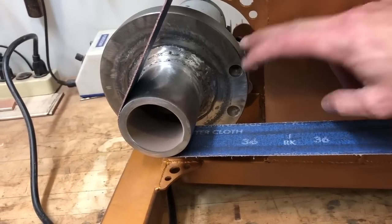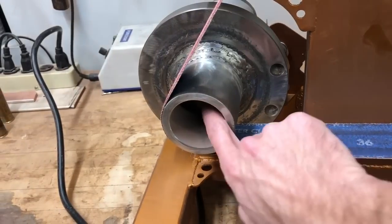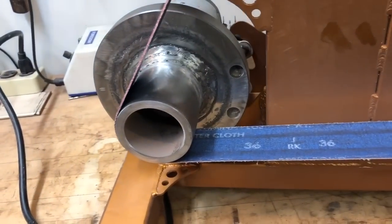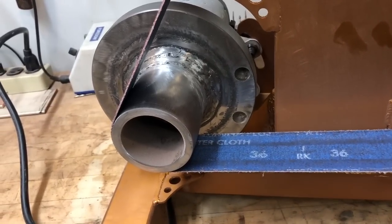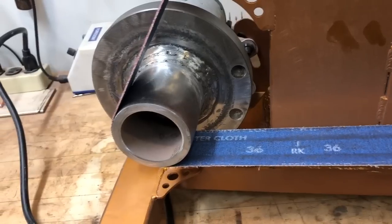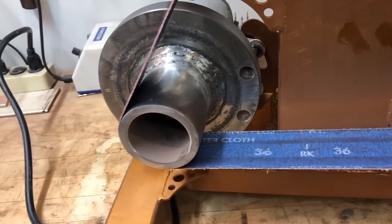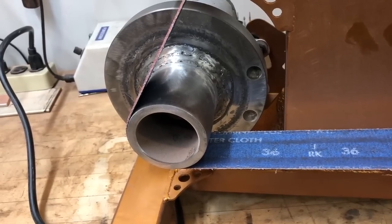As for making the treadmill motor drive the actual belt — what you're seeing is the factory flywheel, and it has a normal belt-driven pulley inside, but it's way too small. So this is a piece of two-and-a-half-inch steel pipe that I picked up from the local scrapyard and welded it to the flywheel, trying to get it as true as possible.